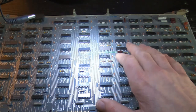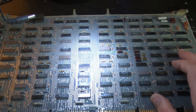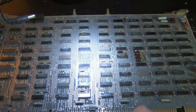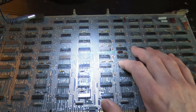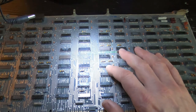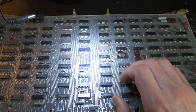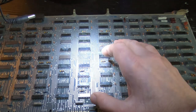As you can see, the board is undamaged — all the tracks are intact, all the pads and annular rings are fine. It took about 10 minutes to do that, working around the camera, so it's not terribly time-consuming. It is worth spending the extra time to go through these steps before you try and pull the chip off the board — far better than spending an age trying to repair the board afterwards. I had the iron set to 320 degrees centigrade, trying to keep it as cool as possible. The solder was very dry and didn't really want to flow, so some pins had fresh solder applied. I'll probably resolder the rest before starting removal.